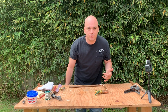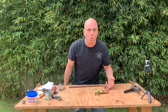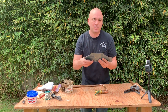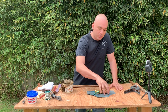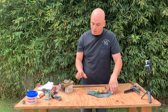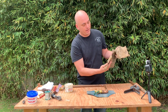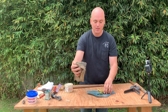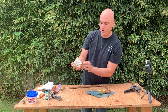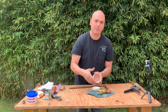You always want to make sure that you have a fire extinguisher or at least a bucket of water, because oftentimes we're soldering right up against wood or inside a wall. I always like to keep a piece of metal to shim behind wherever I'm soldering as a fire barrier to protect the wood. They also make heat barrier rags — this one has been through it but it won't burn easily. They also make a heat barrier putty that you can apply to wood or wherever you're soldering very close, and it gives fire protection.